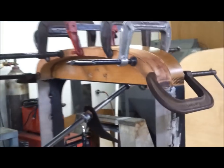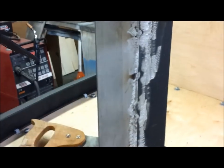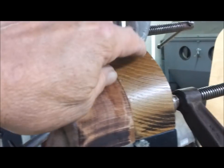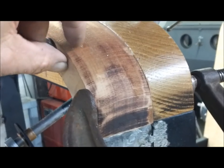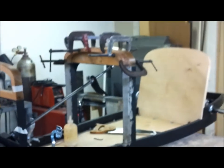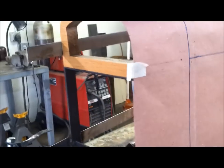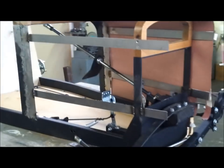I decided to extend the cowl. I had a piece of mahogany here that I cut to shape and made a pattern. Then I welded on these little strips of 16-gauge steel. What this does is the sheet metal will come up and the joint will be about three-quarters of an inch in from here. I think that's going to work just fine. I'm continuing to refine the patterns for the metal body and realized I needed some attachment points, so I laid those out. You can see where I've welded on some strips. This side piece is slowly taking shape to where I want it.